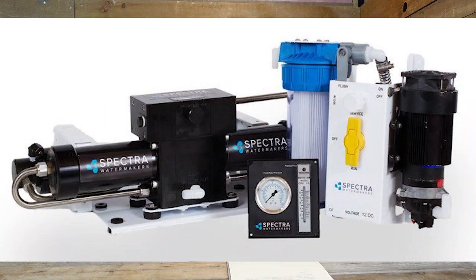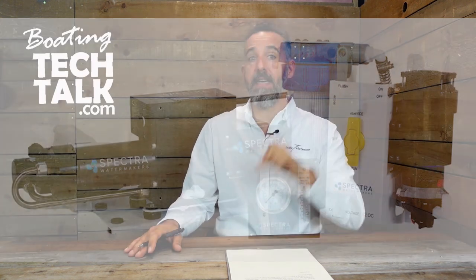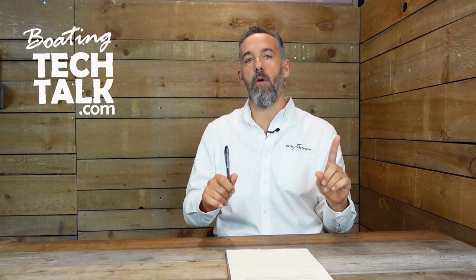The next question is: do you have an AC generator on your boat? If you can generate alternating current — and generally you won't do this via an inverter — and you have a dedicated generator, then you should consider an AC-powered water maker. Most water makers on most boats are AC powered. The exception is Spectra, which can be DC powered. On my boat I went with Spectra because I don't have a generator, so I needed both a modular and a DC-powered unit, which narrowed my choices.